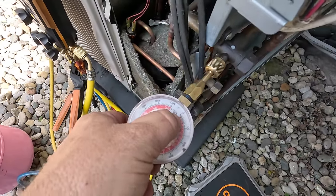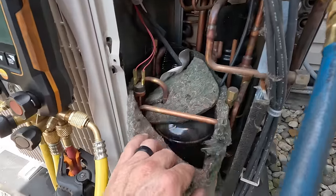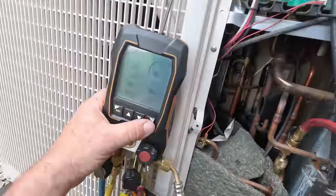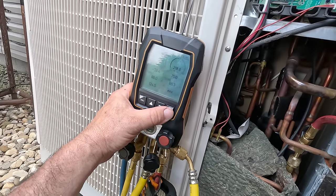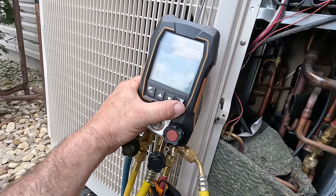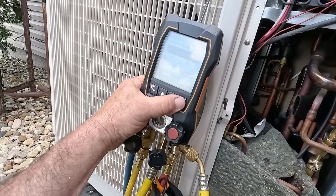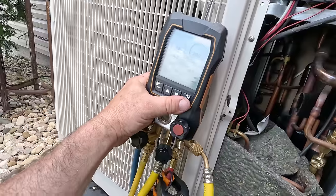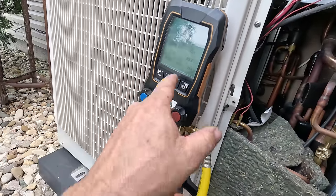My gauge is down about 5 to 10 pounds of pressure — that's not good. There's discharge right there on that one. We're going to monitor discharge just to be safe. We've got everything bled out, we're on discharge. We're running 218 head pressure on a 410 system. Let's go into our menu and tell it we want to charge — refrigerant charging, go to manual charging. There's our meter scale. We'll reset this thing to zero — down to zero. So simple. Let's start adding slowly.